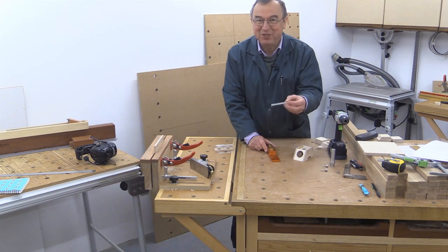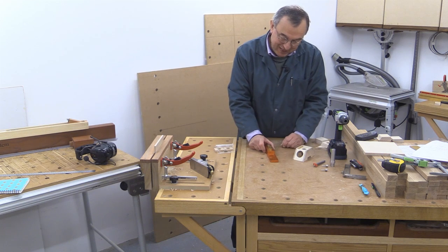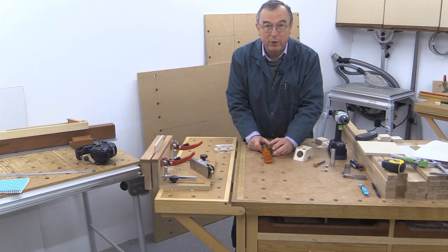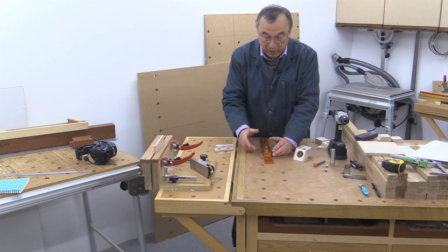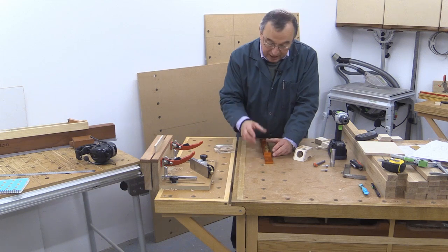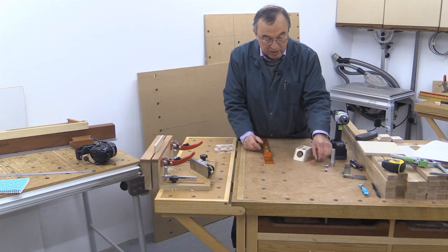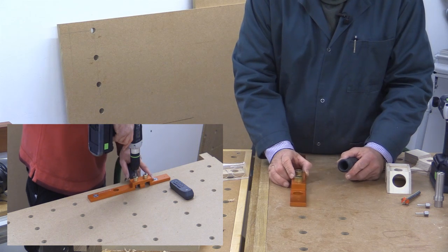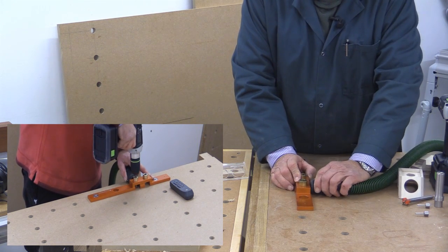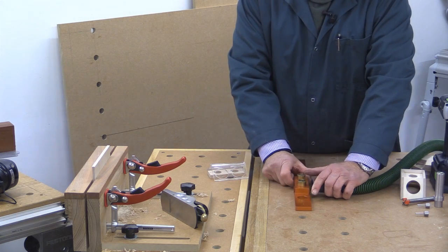I'm not going to miss the opportunity to remind you to oil the shaft or the cutter. But the other thing which is really important is to make sure that you extract the waste as you're drilling. Otherwise, particularly with the cheaper MDFs, it can start to clog and then make the cutter overheat, which nobody wants. And in the various videos I've shown of the Parfguide system, you've seen me put a hose up to the port here and then done my drilling in the normal way.